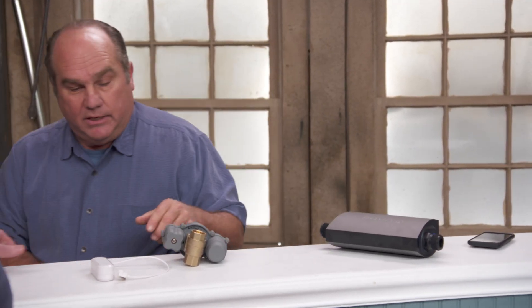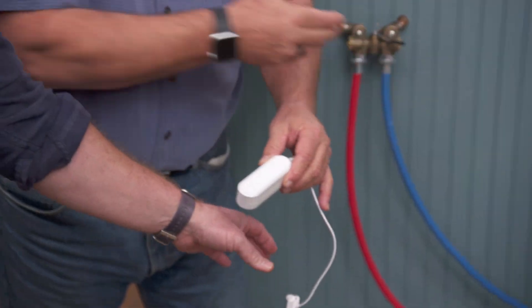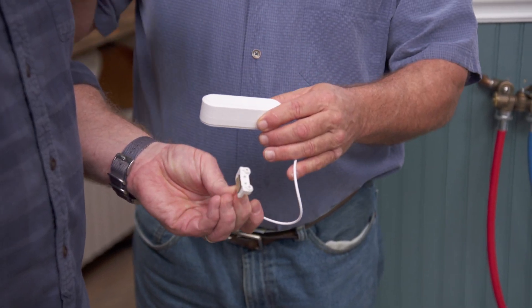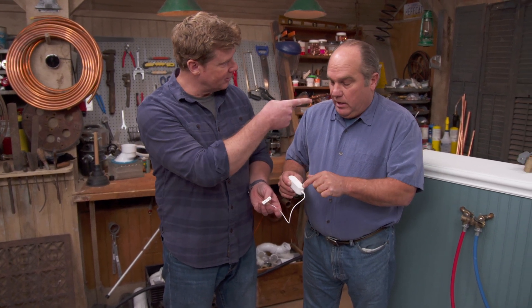In this example, they have these sensors. You can have more than 20 of these sensors, and you'd put them near the washing machine, near the water heater, and the places where you'd have some chance of a water leak. There are two little probes — if contact is made, that alarms. It's battery operated, goes up to the internet, and right to this valve to shut it off.